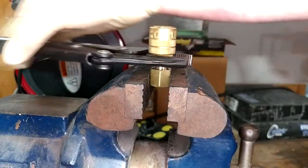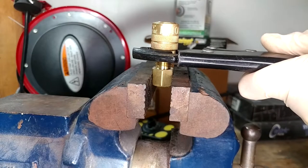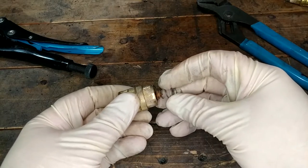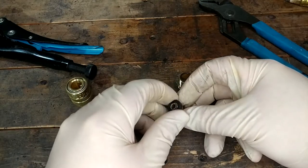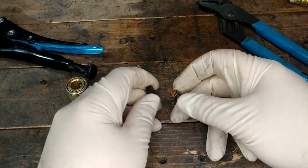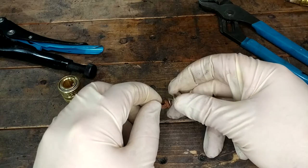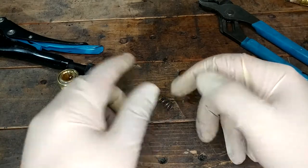It's still plenty freaking tight. You can hear how tight it is. There are probably springs in there. Not too bad — got her apart. You can see I scarred it up just a little bit with the vice grips, but not too bad. We should be able to get our spring out. Look at all the crap that's coming out with it — same story as the other one. So much junk from water and the tank. These things are just corroded. I'll try and contact Milton to see if they have replacement parts. Maybe I can order factory replacements, or better yet stainless, because these things are just chewed way up.